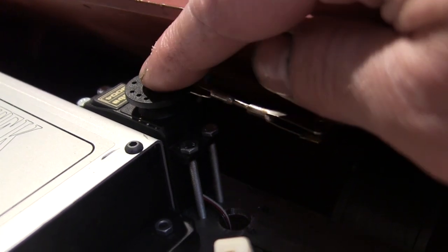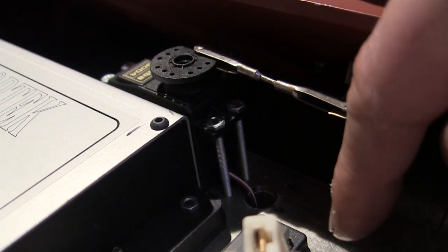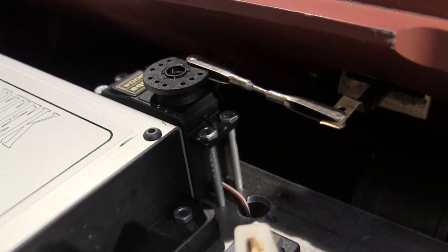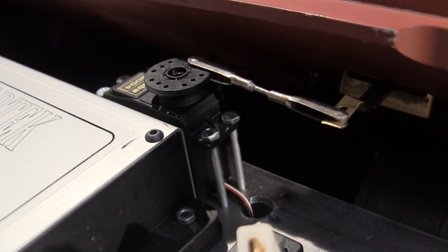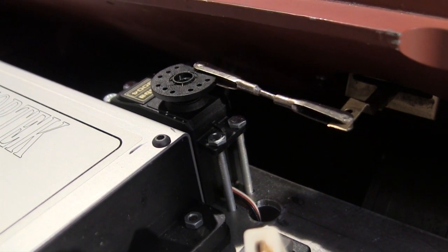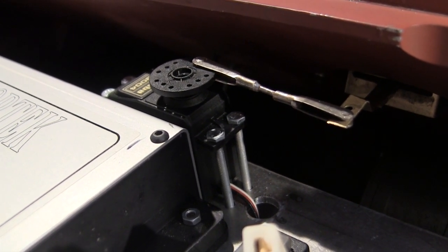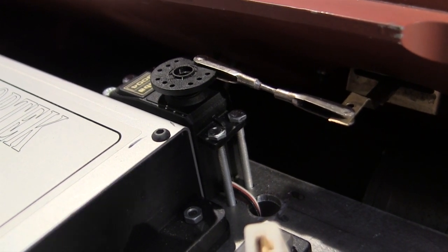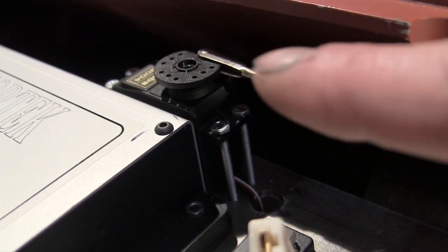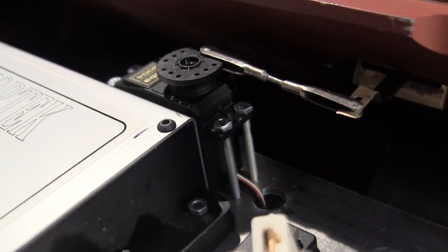However, as you can see, the servo itself is now secured to the plate, and this is facilitated via these 4 fasteners, which do a fantastic job in keeping everything where it needs to be. Some individuals like to use adhesives to mount servos in place, and I have done this in the past. However, fasteners are probably the best route in my opinion. And if you have the facility to mount on the servo using fasteners, well, why not?